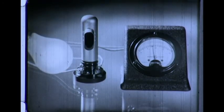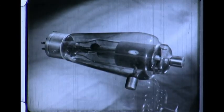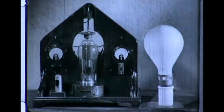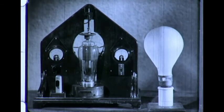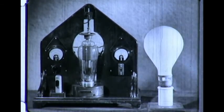Because this current is too weak to be useful, another electron tube — a thyratron — is used. It amplifies the phototube current and acts like a valve to turn on or off large quantities of electric power. Here we have a phototube, properly covered to see light from one direction, a thyratron, and a large electric lamp.